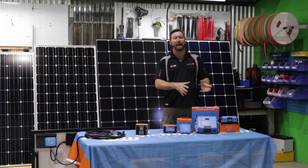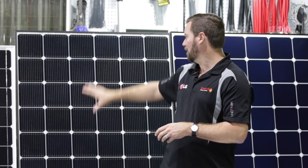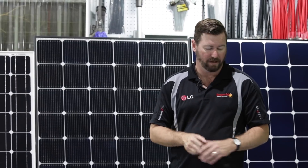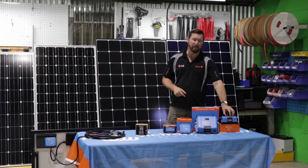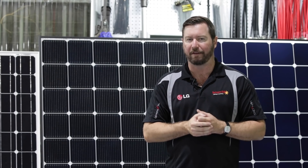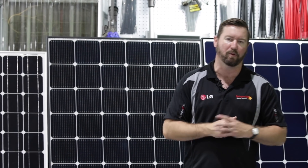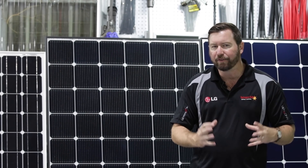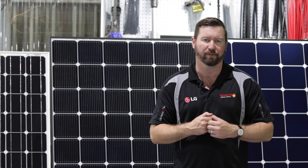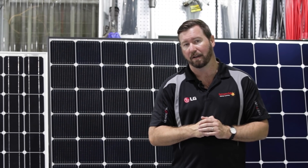An MPPT regulator will get you more energy out of the system. The way it does that is by stepping that higher voltage panel down to a lower voltage battery. These were originally designed for higher voltage panels charging 12-volt batteries. You can use a 12-volt panel on a 12-volt battery through an MPPT, but if you want to push the yield — the overall energy you get each day — you increase your panel voltage. Going from a 12-volt to a 24-volt or 20-volt nominal panel to charge 12-volt batteries also reduces cable losses, since higher voltage output from our panels means lower current on the input side, which means less voltage drop and less losses in those cables.